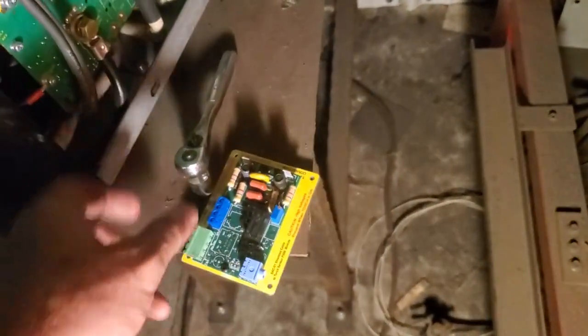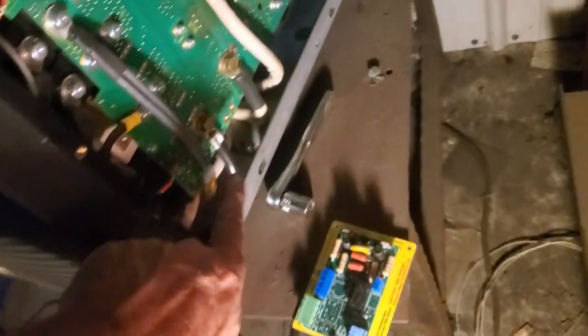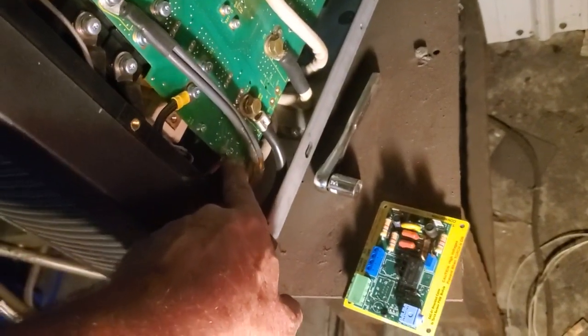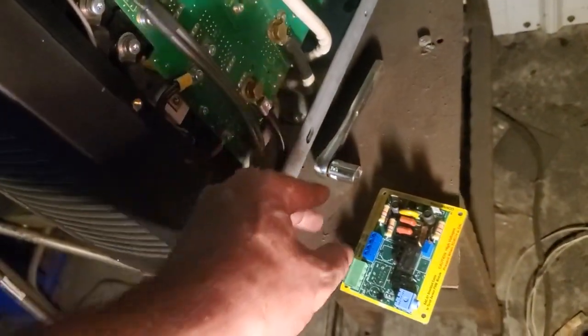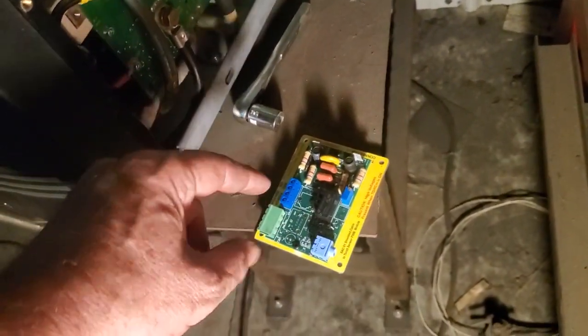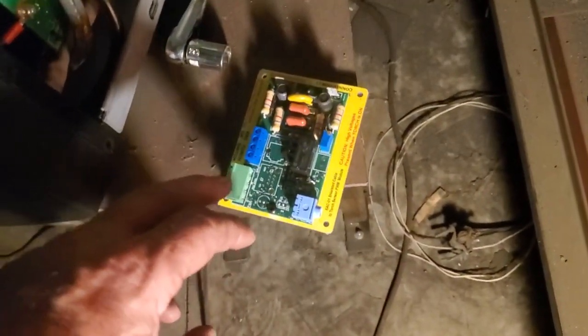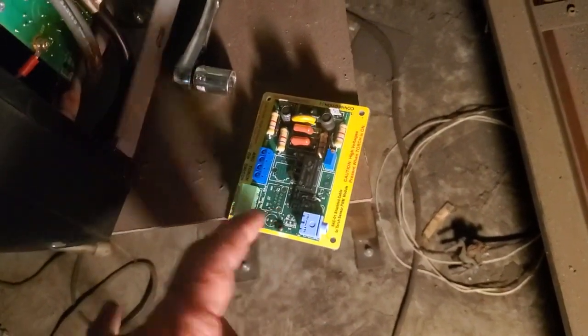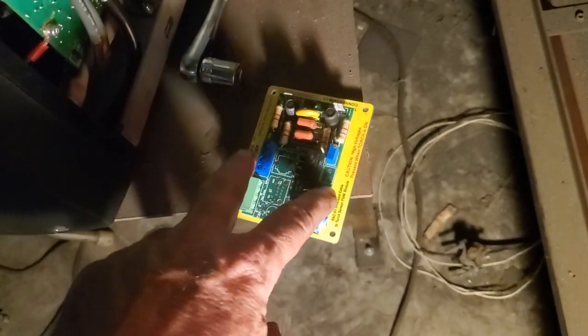So what I would do, per the instructions, is tap into this bolt and this screw. I'm going to crimp some connectors on, bolt on there. I'm going to run 2 wires, and I'll find a place inside the chassis here to mount this board, and I will connect them here and here to the appropriate places. And then there is a stereo cable that plugs into the stereo jack, takes that out to the PWM. And in my case, I don't need to use the other control circuits on here because they're already present in my 105.